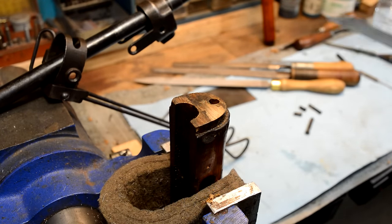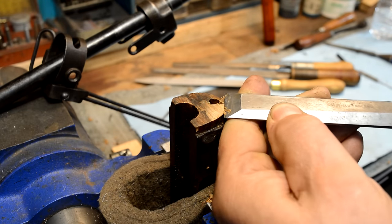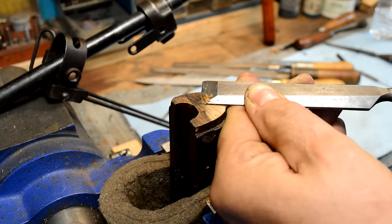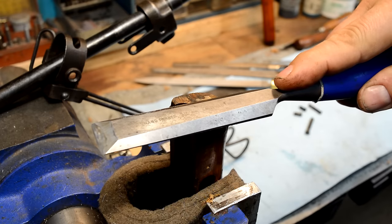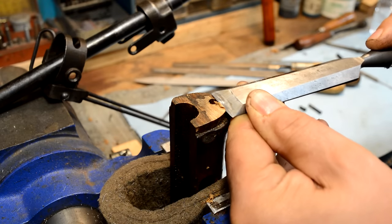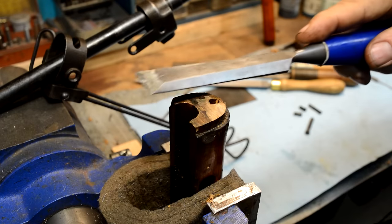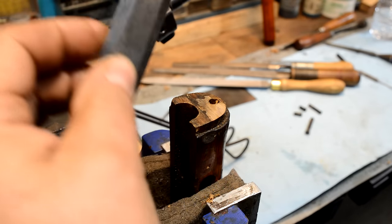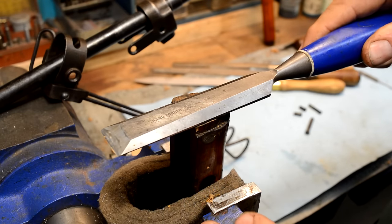Okay. Got to go a little bit more here. I'm doing this optically. It doesn't have to be flawless. The guy that cut this off, you know, cut it off with, I don't know, a sawtooth bayonet. We'll get this down. We're almost there. So anyway, the point is, this edge, this surface right here, has to be flat and perpendicular to the long axis of the barrel when we're all done, in order to make it go. And it's still, you can see it's still rocking right there.